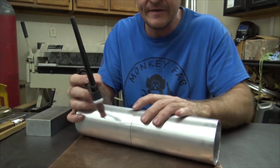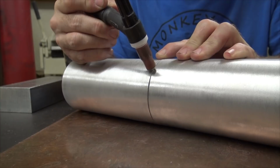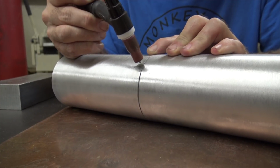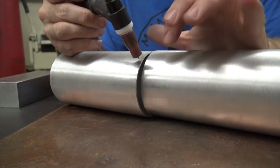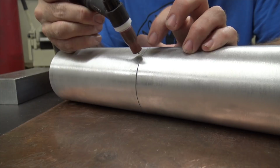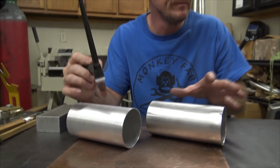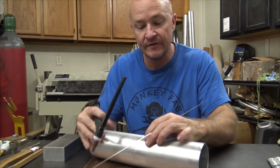So we'll tack these just like I showed in the tacking video. I'll drop that link below too if you need it. I'll give it a little scratch and gray for a second, let the cleaning action work on it, get some heat into it, and then I'll start walking my pedal down to get those sweat beads to form on either side, and I'll dab it. We'll tack it in four different places and then we'll weld it. When I go to weld, it's going to be just like I showed you in the tube welding video. We're going to get ourselves nice and comfortable.